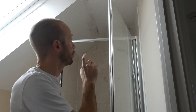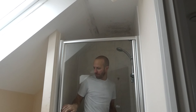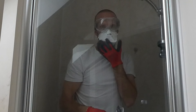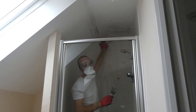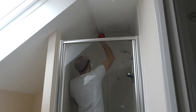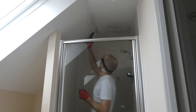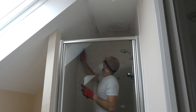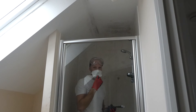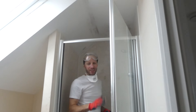The first thing to do is just scrape the ceiling — try and get any loose material off. Got my gloves, got my PPE, let's do it. Around the edges the sealant has started to fail so I might have to do something about that. Some of the paintwork is quite flaky. Well, I've got most of the flaky stuff off — it's not looking great but I think we're going to have to clean it up, seal it and then address any issues after that.